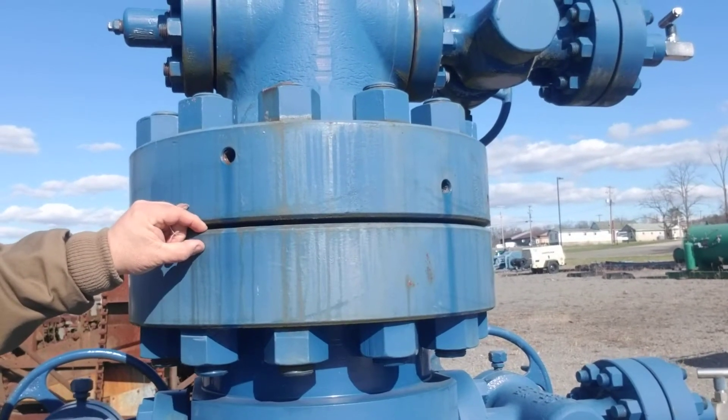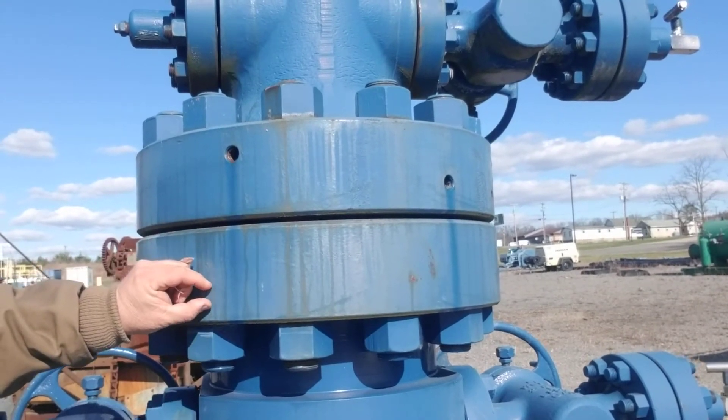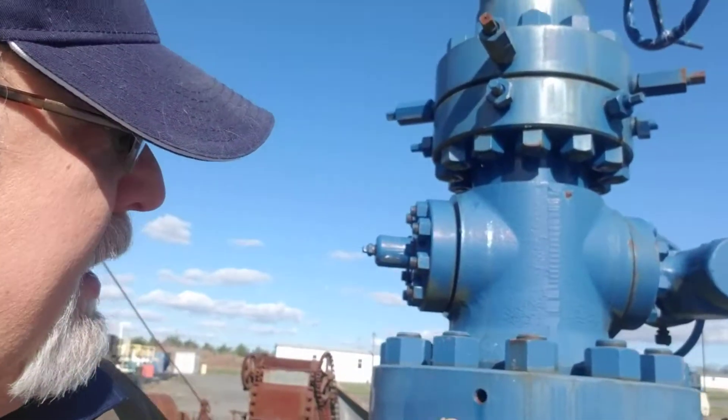So if you look at this, let's go one, two, three, four, five, six — we'll call it six in my bad form of measurement. So three inches, that means you're looking at 3,000 PSI for just the flange. I would guess this is probably up to four or 5,000 PSI flange here because my measurements are probably off, but it's a good guess.